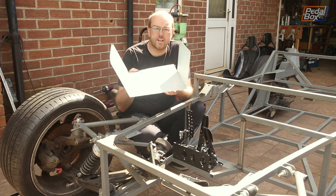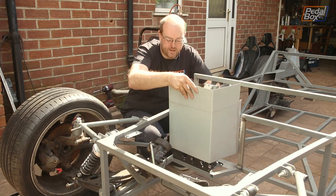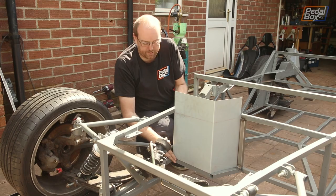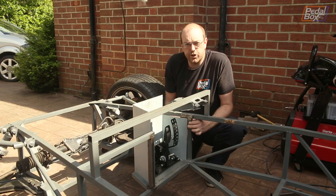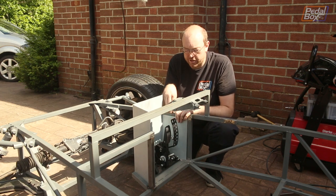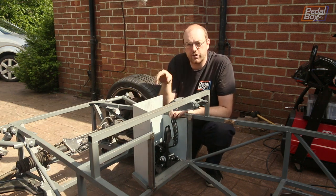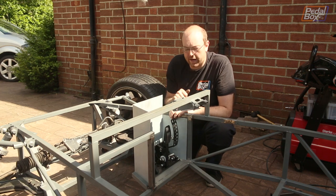After a good deal of cutting and bending, this is our driver's footwell. It fits in around the back of the pedal box and tucks in quite nicely, aligning with our platform. We ended up shortening it down so it doesn't quite overlap the tube on one side but does on the other, because we had to tuck it ever so slightly underneath the top tube — our tolerances are that close. We've still got all of the top section on, because we're not sure exactly how we're going to fit it around the steering column when we put it back in.